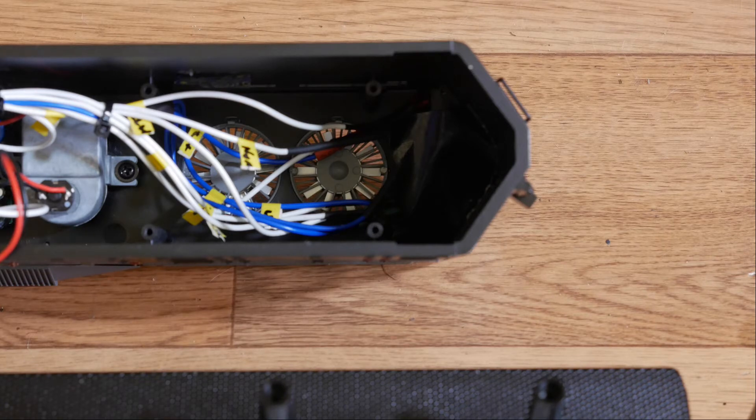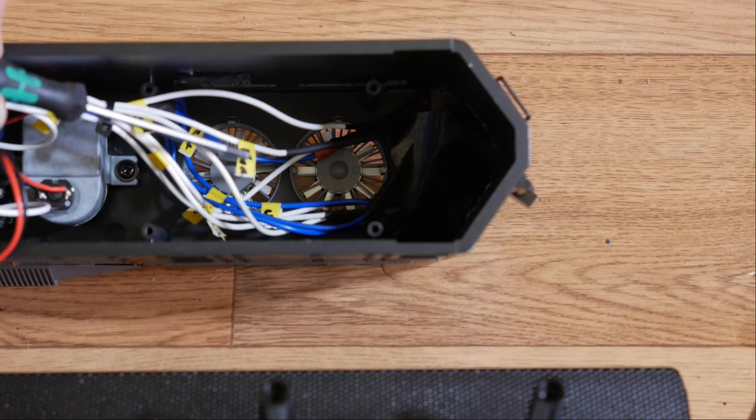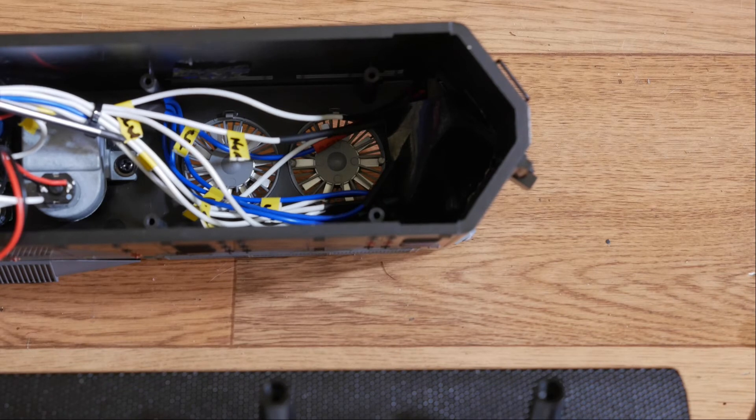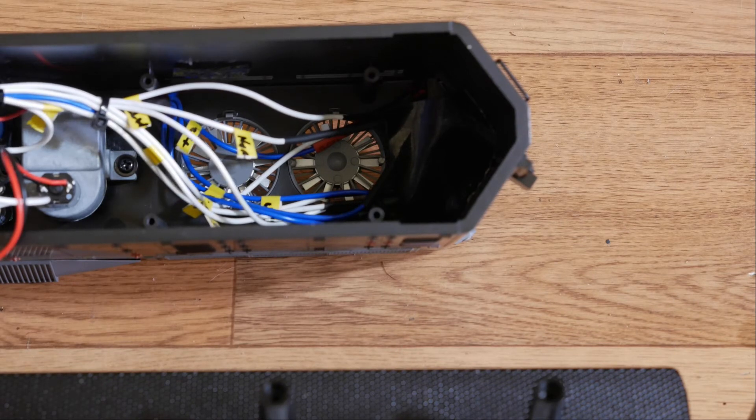In this loco I've wired classification lights for white going forward and red in reverse. You need a lead each side — it's pretty difficult to use just one lead to do both class lights — so I've used one lead each side, effectively one white and one red each side. That's why there are so many wires here. Each wire is labeled: headlight rear, class lights red, and so on. I've used the same wire throughout to keep it consistent.